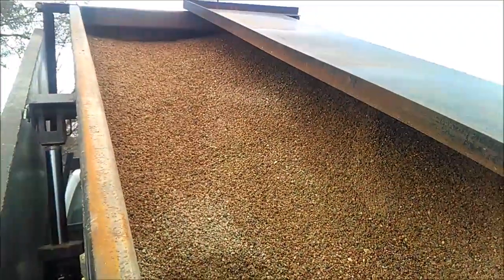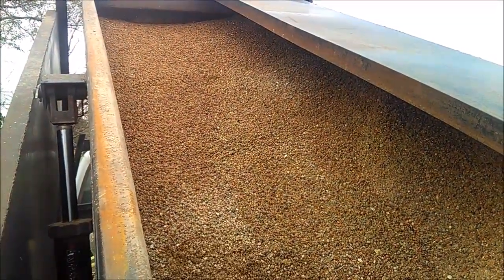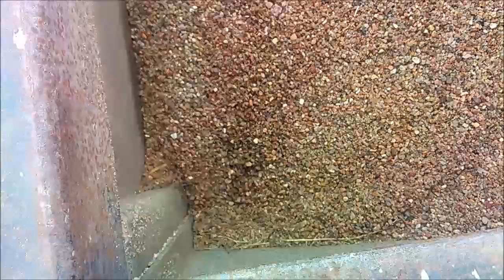We run gravel pack from the bottom of the well up to the base of the grout level, which in this case is 40 feet. It'll end up taking almost all of the 3 yards brought along.